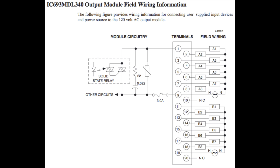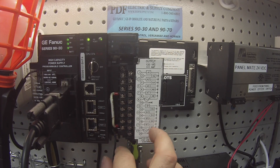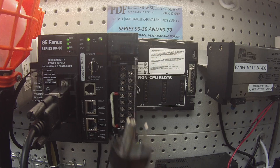In order to do this test I have a couple fixtures here, some things that are already set up. According to the door card, if you look at this insert in the wiring diagram, terminal number 9 and terminal number 19 have a hot lead on both of them. So you can see that I've got this jumper from 9 to 19 with a hot lead coming from a 120 volt AC power cord that I'll be plugging in for this test.